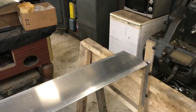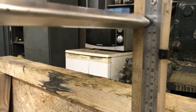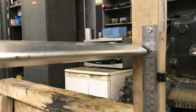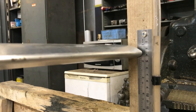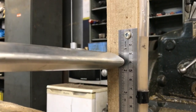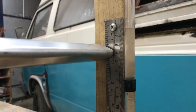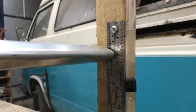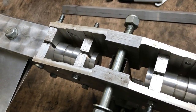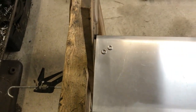We've got 35 on that side and 45 on that side. If we now add two M6 washers, we'll watch and see if it levels out. After five minutes of bobbing up and down, I'd say that was around 38–39mm on both sides. That is our rotor balanced. It was only teetering on a single bolt box section, and two M6 washers is what it took to balance it out.